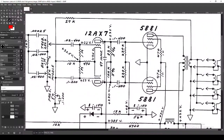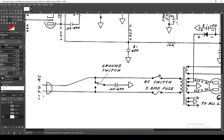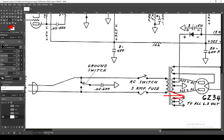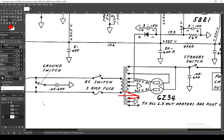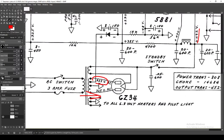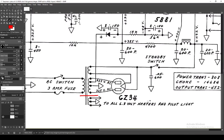That is everything in the main audio path. Let's touch briefly on the power supply. The power supply was designed to see 117 volts AC, which is fascinating because currently your wall outlet probably measures 120–125 volts AC. That gets multiplied through your power transformer and results in a pretty hot amp — your B+ by the time that 125V AC goes through the power transformer won't be 325V AC, it'll be 340–350V AC. After rectification it won't be 432V DC to the output tubes — it'll be 450–460V DC. That's what's called voltage creep.